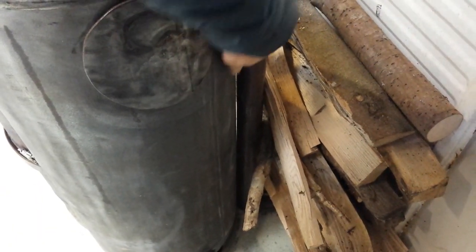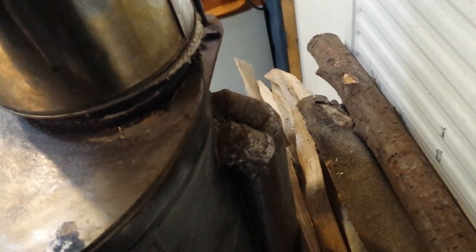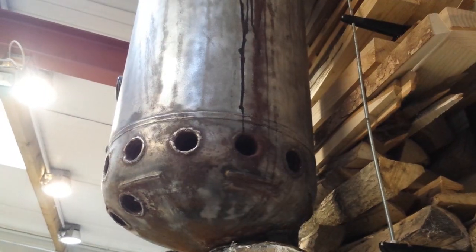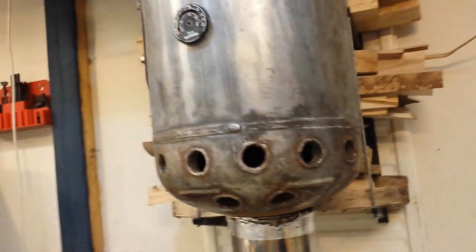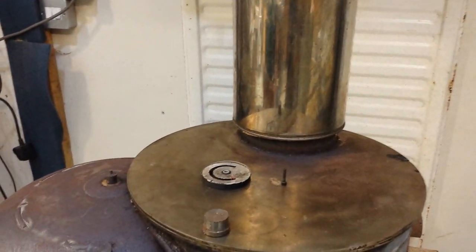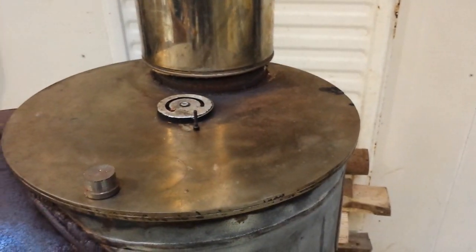There are the two infeed pipes coming from outside taking primary and secondary air into the burn unit. They give the outside air a smidgen of preheating, but that's all because the old unit is really well insulated — hence the close stacking of the logs without fireballs of death. There's another intake here that takes in actual air from the shop. Moving up, we come to the heat exchanger itself. The holes let outside air come to the inside of the exchanger, which effectively doubles the surface area. If what I'm saying makes no sense, check out the blog post on Flowering Elbow — link in the description. There are a couple of stove-top thermometers, one on the hot plate and one on the exchanger — really useful for diagnosing what's going on in the burn.